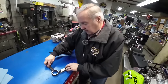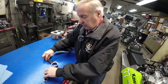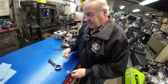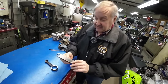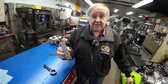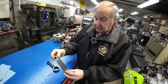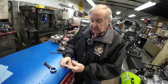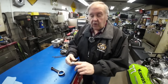As this goes around, you can see how everybody would be happy. I'm fascinated. That idea never occurred to me. I thought you had to stack the connecting rods on a common crank pin. In fact, this connecting rod is out of that. This one here is the one I made out of 4340 bar stock. Did you harden it, grind it, all that? It was induction hardened on the pin sides, and then honed.